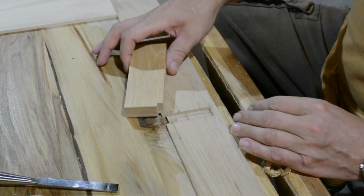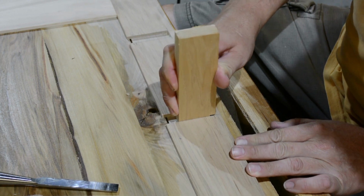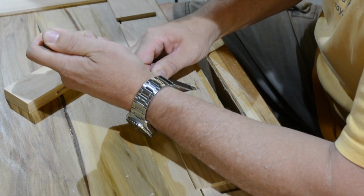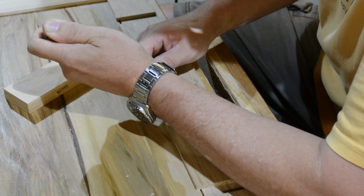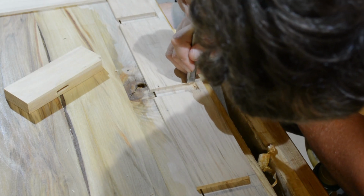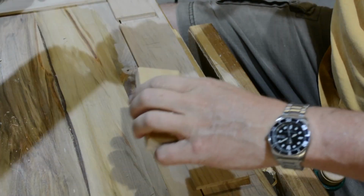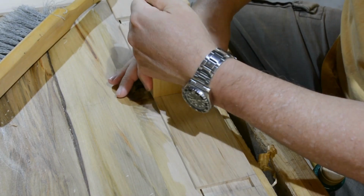Prior to glue up or even dry fit, I've got a mock piece of the drawer web front style, and I'm test fitting it and trimming as needed to be sure that it fits perfectly and that the front of the drawer web piece will align with that mark I've made for the correct reveal. At that point, that's the fit I'm looking for.